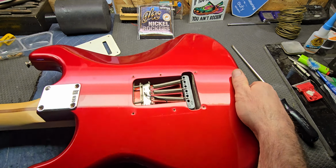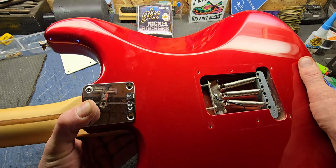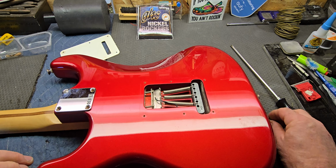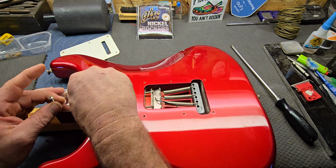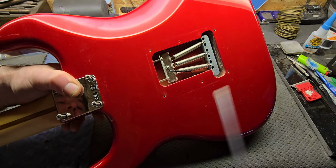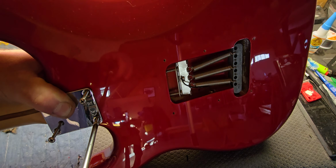Okay, on to the neck bolts. Now, when I bolt the neck up, usually what I do is I'll hold it in the pocket tight and just kind of pinch my thumb and my hand like this, and just hold the neck in there, give it a good squeeze. I'll get one bolt started in and just kind of snug it. Now, I don't crank it right up tight yet. Just make sure I get all the other ones started in there correctly. And the same with that. I'm going to hold that up, and I'm going to probably tighten this one opposite corner first, and then I'll proceed to the next one in the back. So again, I'm going to hold this up like this. Take my screwdriver. And this is just to get started. Now I'm going to check the alignment of the neck too, but a lot of times this will get you right where you need to be.